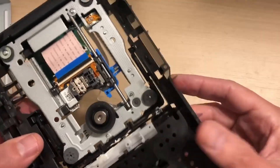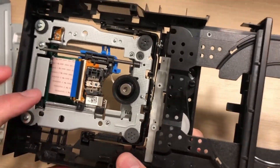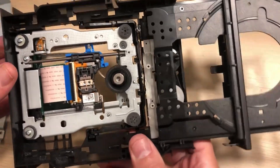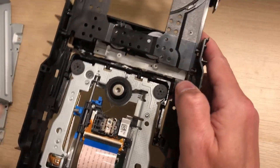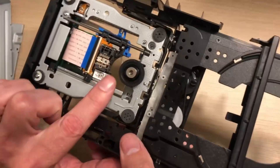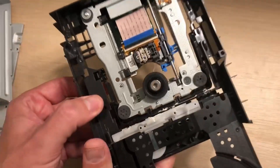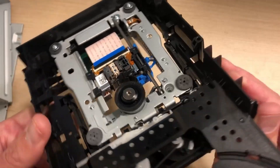The multimeter was very useful — I was able to detect there was a break in here. It wasn't obvious that there was a break on the original wire; it looked quite straight, as if it was connected fine. The weak point is likely going to be these top two wires here. On this particular fix it was this one, but you might find that yours is broken on the top. It is quite tricky — you will need some good eyesight, probably some powerful glasses.